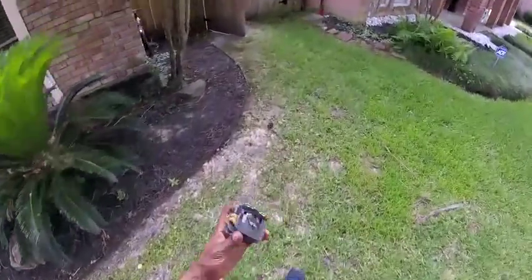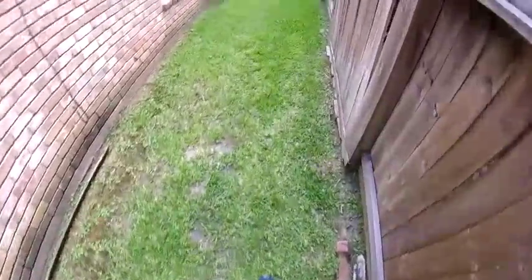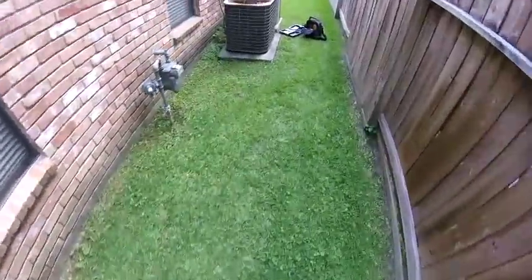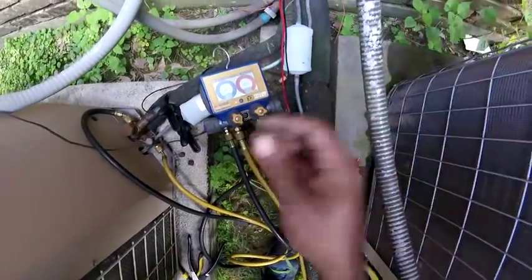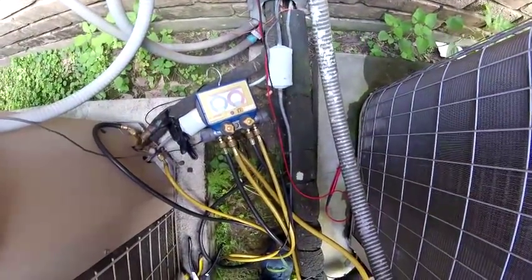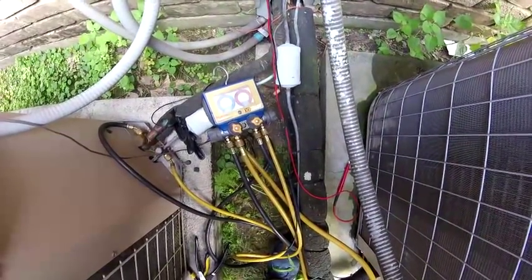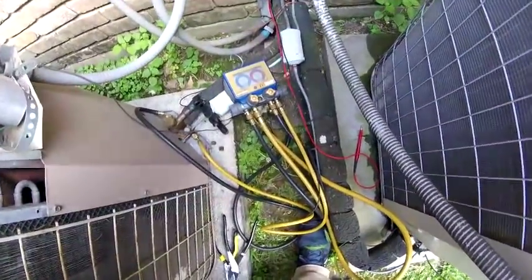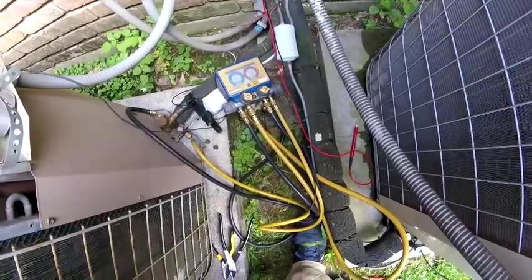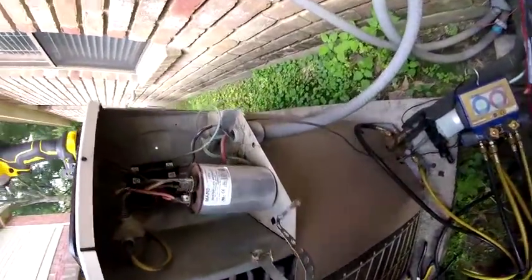All right, I'm gonna change this contactor out and wait on the homeowner. Give him about 10 minutes, see if he's gonna call back. If not, we got 59. And there was an orifice, I think. Well, I sure ain't look when I was up there. But I think we good on it on the refrigerant side. Superheat kind of high though, but like I said, it's real hot up there. Need to let it run for a while.